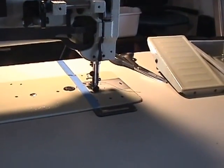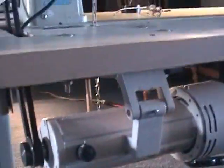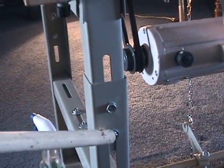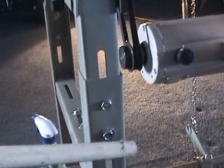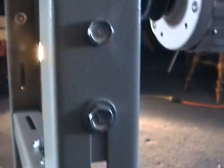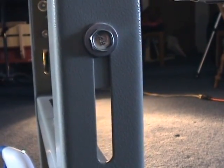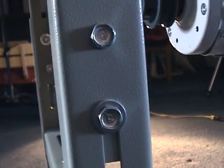Look for it — it'll be on YouTube very soon. Now, you have a mess of bolts that come with this and you don't know which washers go where. What I've decided works out is: the bigger washers go where a nut head or bolt head is on a slot, for support. You only really have enough big washers to go where a bolt head or nut head is sitting on a slot.